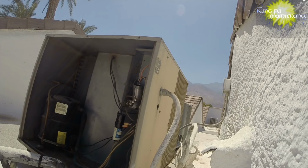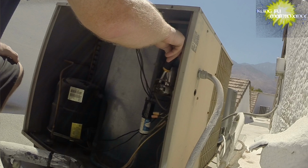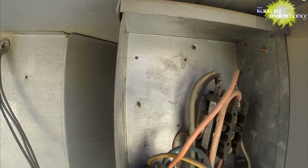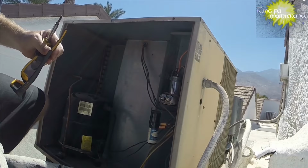Okay, so a capacitor holds a charge in it even after the power is disconnected. So we need to discharge our capacitor by bridging the leads, and that cancels out any charge that's held. And I'll go ahead and get the little fan one as well. Just peeking in there a little deeper. Both our red wires on the right side with our black wires on the left side. Everything looks okay there, but again, we'll be changing these out. We could test them after.